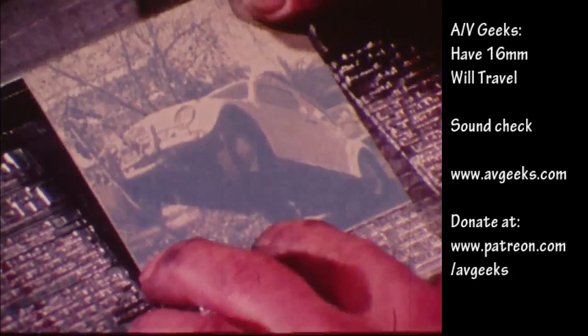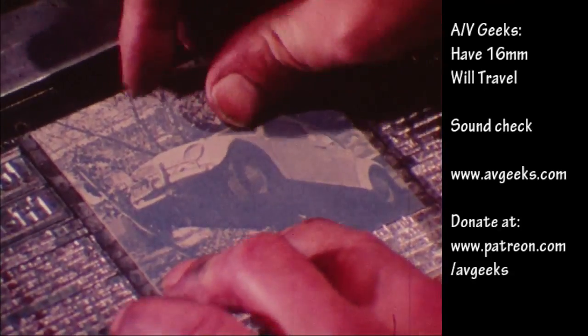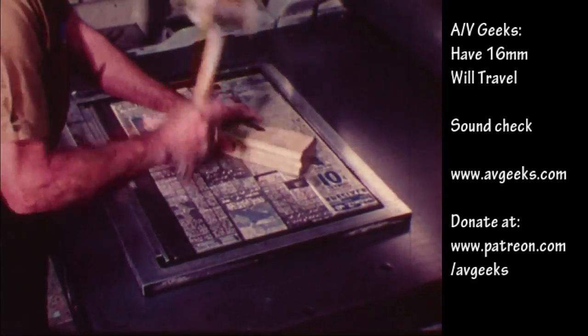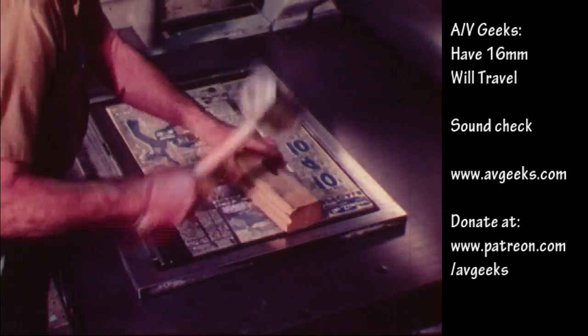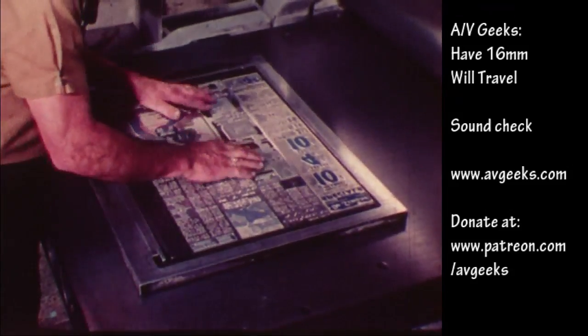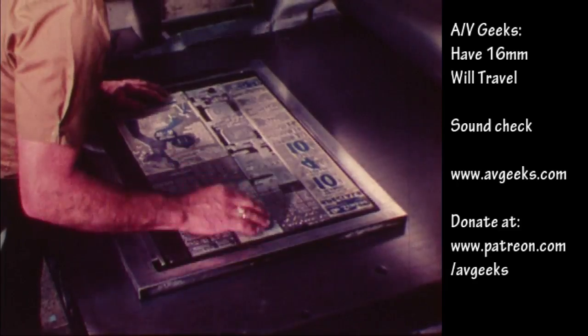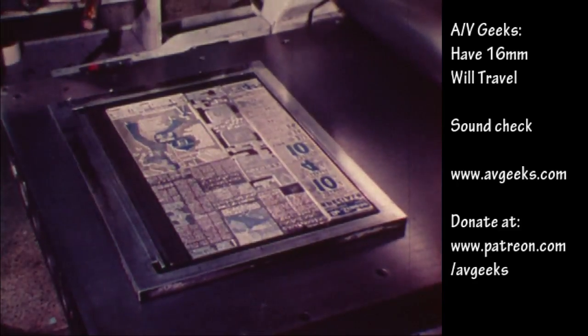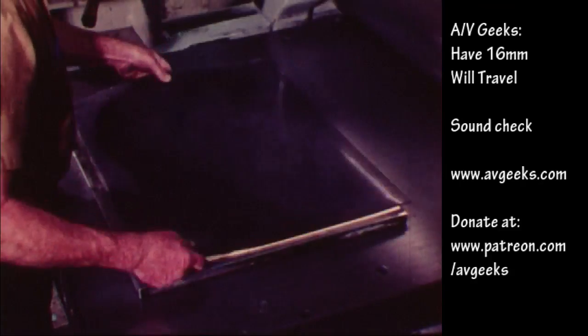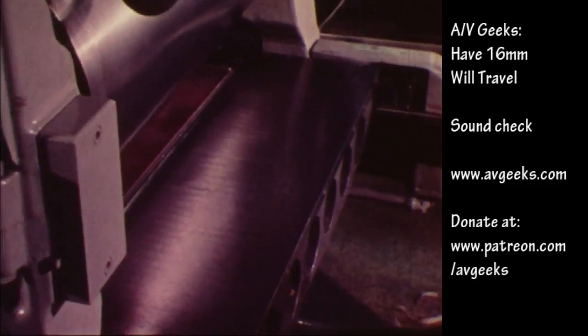Now the news photos, composed story type, and display ads come together for the first time in the chase. But the newspaper page is still two steps away from press time. Using a fiber-like material called a mat, a mold is made of type and plates. The mat is covered with a blanket of cork and a sheet of steel and sent through the molder under high pressure.